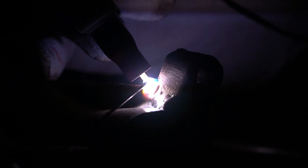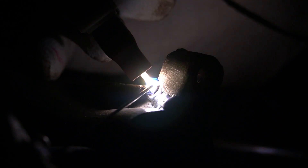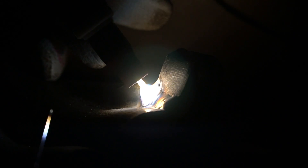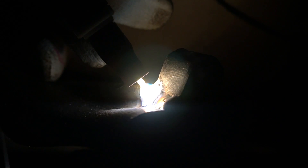Here comes another little goof. We're trying to build up that little bit of a lip on the inside of there — just some nice little dabs — but there goes the tip and dip. It happens to the best of us. Either way, a little bit of buildup in here. Again, we're displacing metal — a little bit of an edge there that came around the end of the manifold. It was kind of like a gusset cast into it to give it some strength. I need to build that back up as well, but we're building it up on top of fresh metal. We're basically doing a stack on top of a stack on top of a stack — just little stuff to get this in there and build it right back up again.